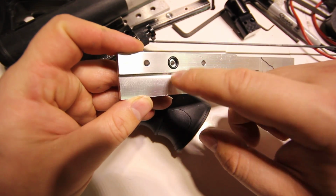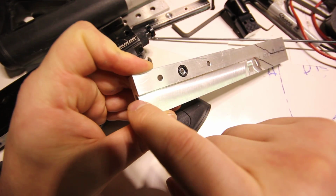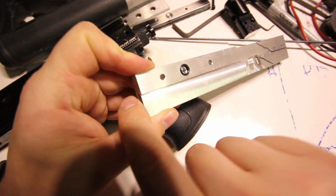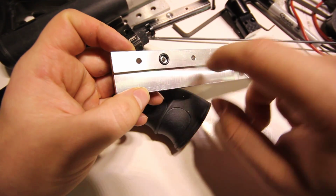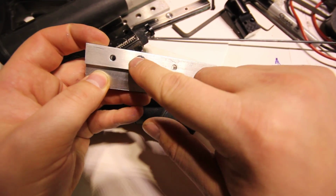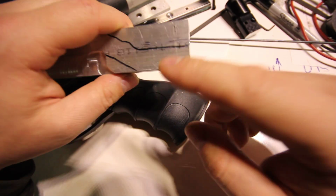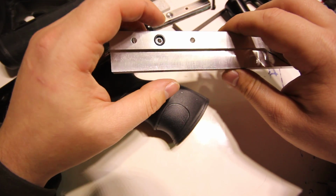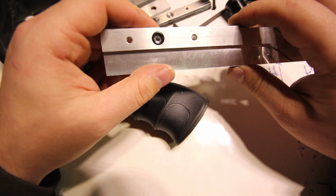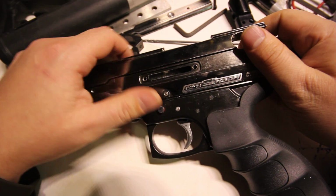Anyways, so I fabricated this thing so the channel goes from here to here, and then to get the channel up to this hole, I drilled another hole going this way. And I would plug up this end with a set screw and Teflon tape, so the air would get from here to here into this hole, and then it'll go into the gun. And on this side, I'll plug it up again and make another O-ring interface to go to my ASA. So I built this thing, took me 4 hours to make all the measurements and, sorry, cut all this stuff.